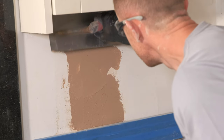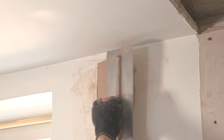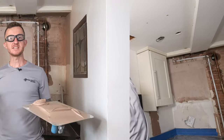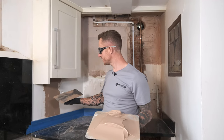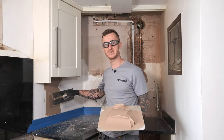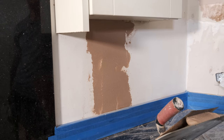When you're applying the first coat make sure you haven't got any big lumps anywhere and try and keep your edges as tight as possible. The first coat is on — keep your edges nice and tight because the last thing you want is to be fighting against the edges of the plaster when you come to flatten off. I'm going to leave this to pull in enough now, ready for a flatten.